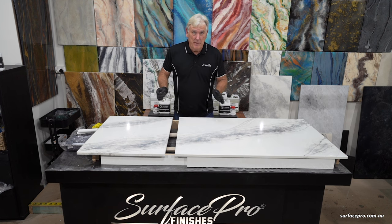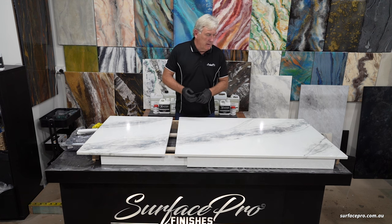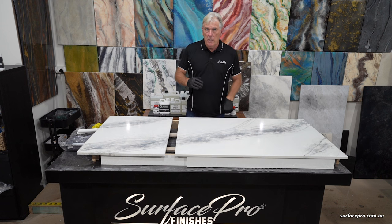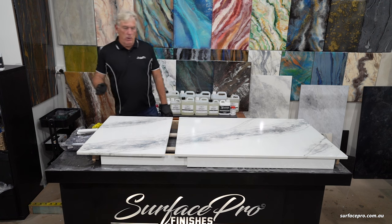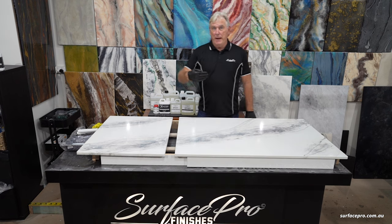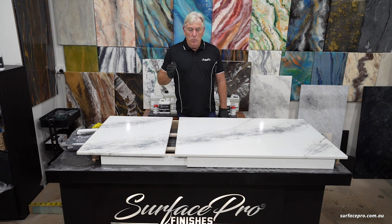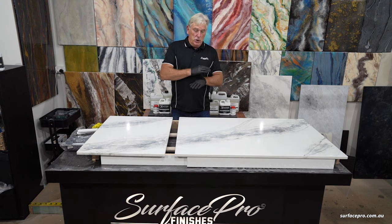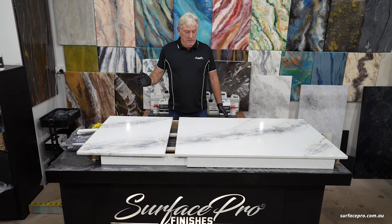So guys, I've just completed that. That probably wouldn't have taken me 5 minutes, I don't think, to do that. I'm very, very happy with it. If you follow the simple process, the simple steps which I've laid out, you will achieve a very, very good finish. Now, I'm looking at this, it is wet, but there are no lap lines at all. I cannot see any lap lines running across because I used the wet roller and drew it back to me as a final pass. And then I got the dry roller and I did exactly the same. That process, that pattern will give you a finish which will be without lines. It's going to dry smooth, silky smooth, and it looks fantastic. I'm very, very happy about it.